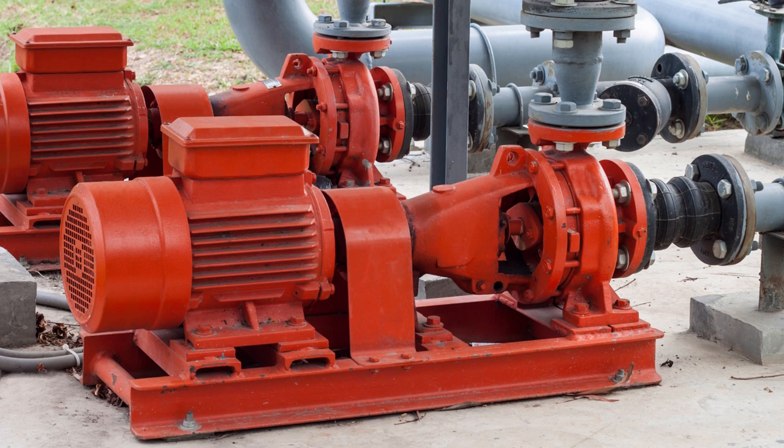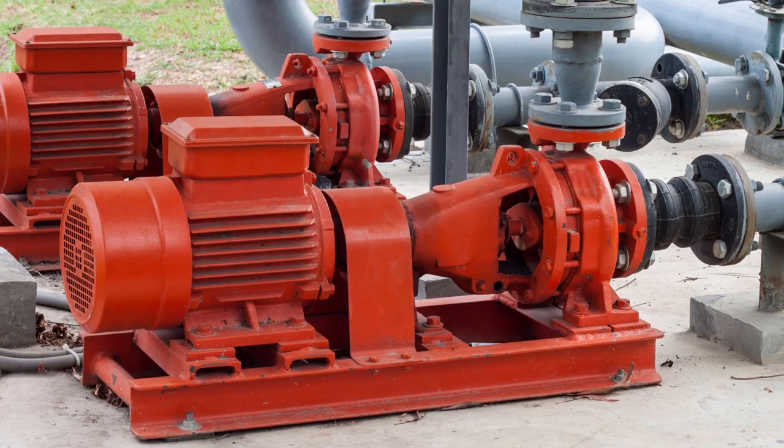This next orange pump has no separate foundation — as you can see, this pump is fitted directly to the concrete floor. We don't know the thickness of that floor, so we also don't know if this floor is capable of absorbing all the torques and vibrations. In this case it's very important to check the vibration of this complete pump installation. In my opinion, this is not correct.